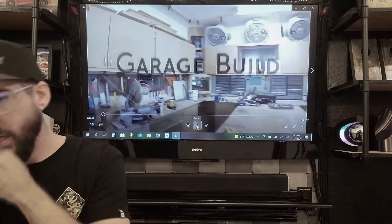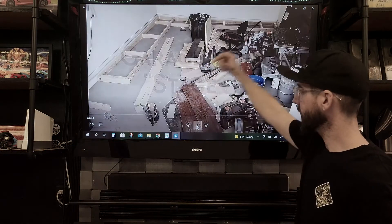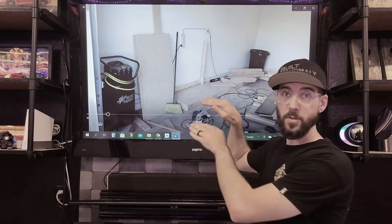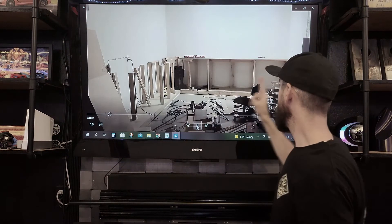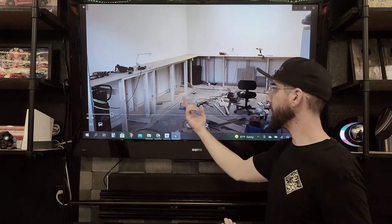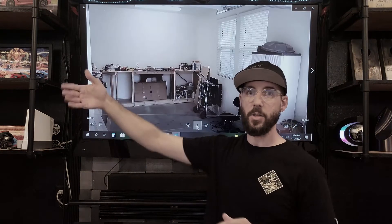So stage one — we're going to go into the base cabinets. This is my setup beforehand: two-by-fours running across, and then you add shims on the bottom because all garage floors slope down, so you shim that up to make them all perfectly level. From there you're standing two-by-fours up — these will be theoretical walls. I'm using pocket holes with glue, and I'll use the three-quarter particle board for the dividing shelves. From there you're just making doors.